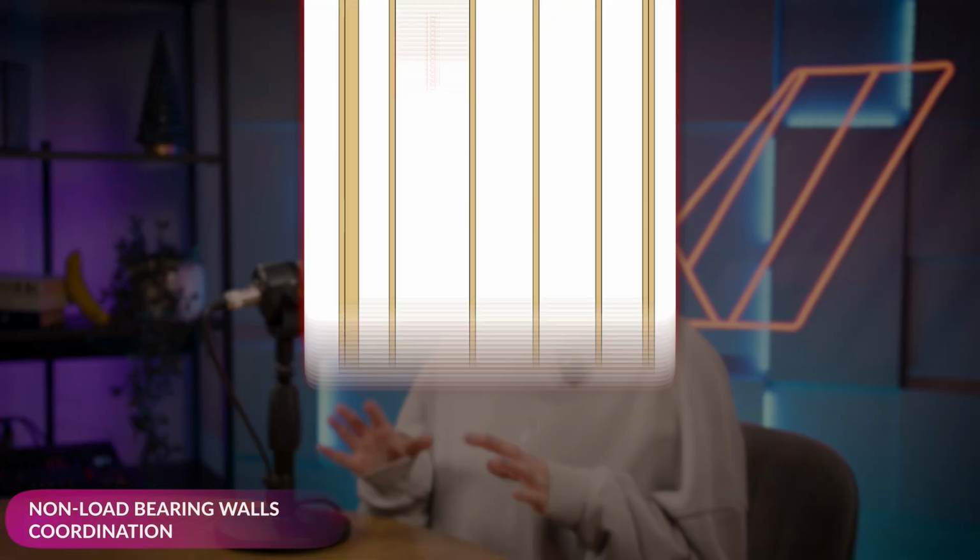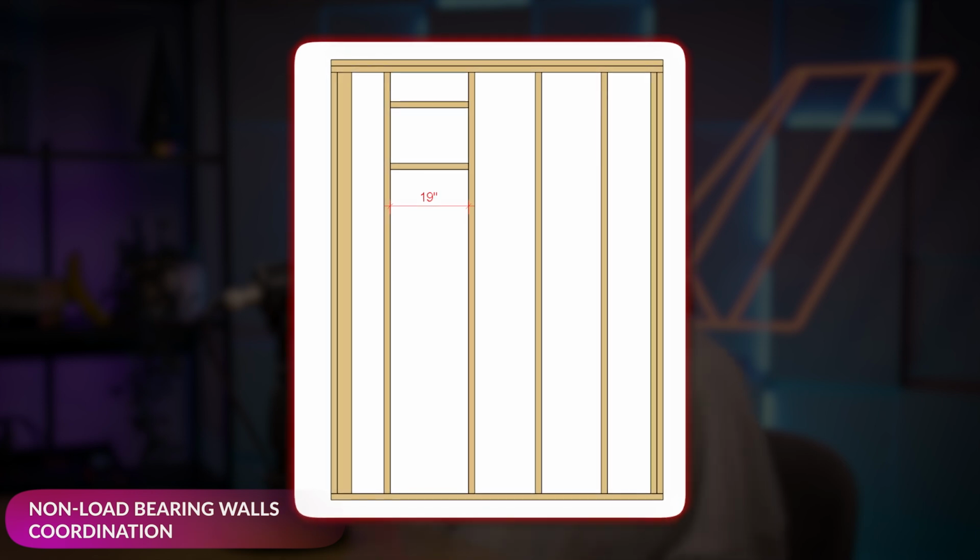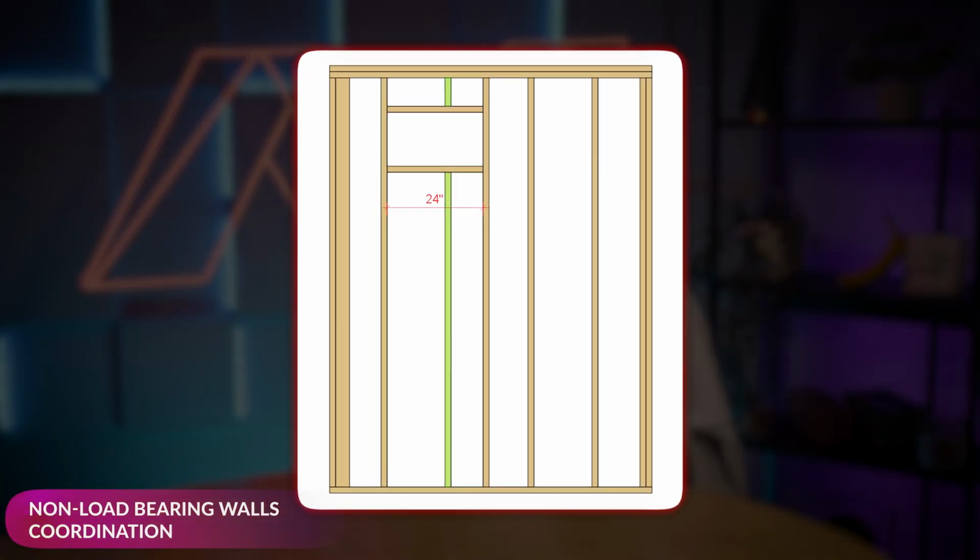In these panels, there is less need for additional framing. The open bay for the system can be spread up to 19 inches without adding any extra studs. Just add blocking below the duct. If it exceeds 19 inches, you'll need to add cripples below. The stud spacing can also be adjusted to reduce the number of studs.